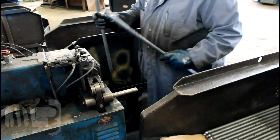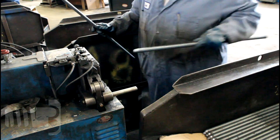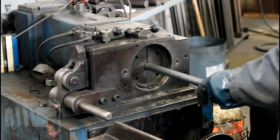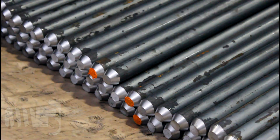Once the material is cut to length, we put a semi-cone point on the end prior to threading. The purpose of the semi-cone point is to provide ease of installation into the wooden member without the threaded end of the bolt getting snagged on the wood. The semi-cone point is added to, not included in, the length of the bolt.